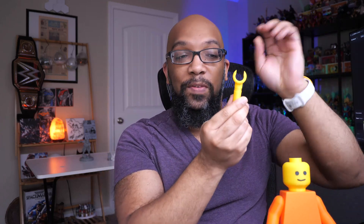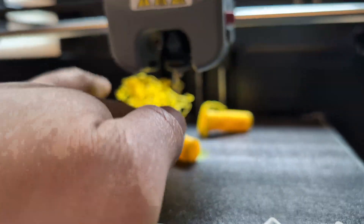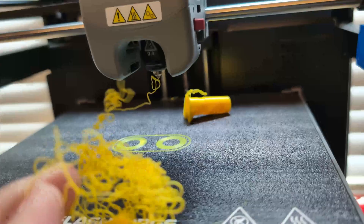The minifigure hands need to be printed with the hands facing up and the wrist part facing down. When I tried printing it a few different times, it would get knocked over — even with the brim it was getting knocked over. So I did the same thing: cleaned the bed, slowed the print down, and it was successful. If you're having trouble with things like this, give that a shot and hopefully you'll see some success. Thank you all so much for watching — subscribe for more videos coming soon. Take care of yourselves and I'll speak to you soon.